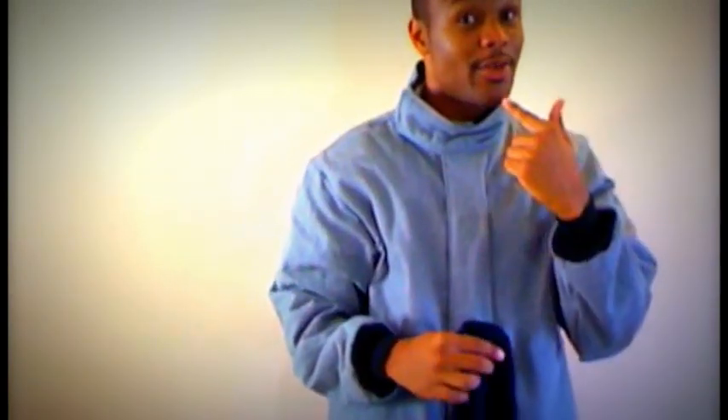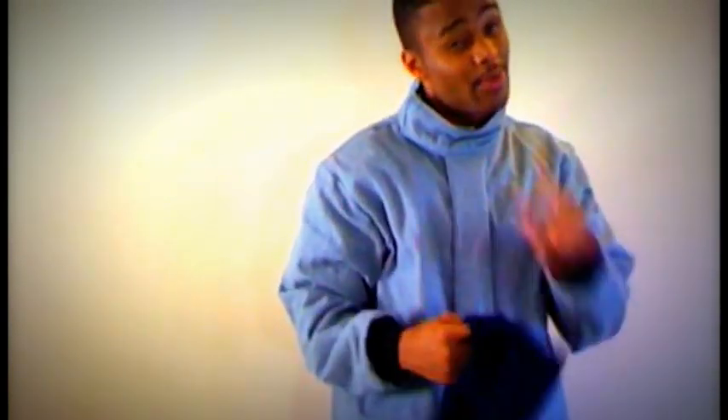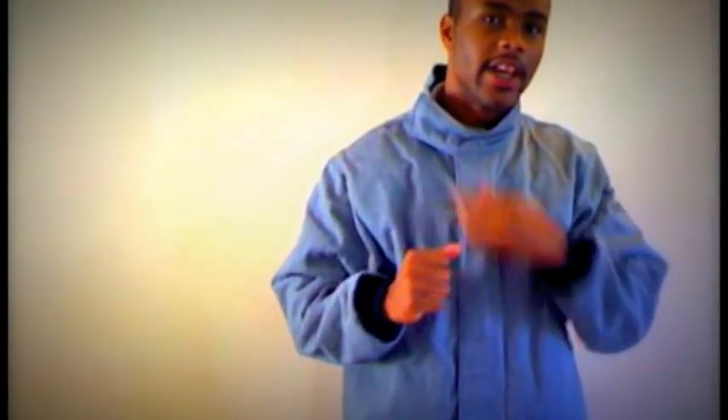As you can see, I'm starting to sweat a little bit. So you may want to look into a hood ventilation system, because it was about 20 minutes and I'm already starting to sweat — it does get a little warmer. The benefit of having a green suit when working above 40 calories is that it doesn't tend to get as warm as some of the navy blue suits or the darker grays and blues. It tends to allow the heat to rise somewhat, but always look into those hood ventilation systems.